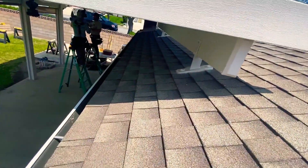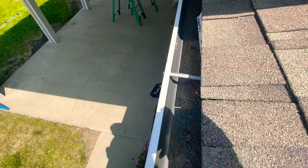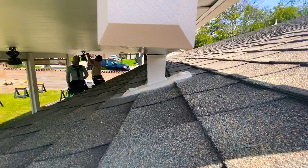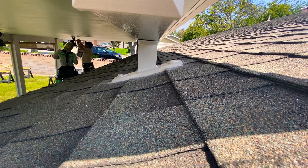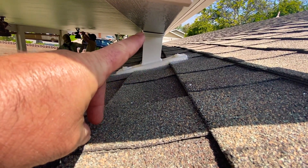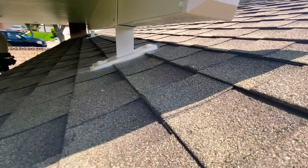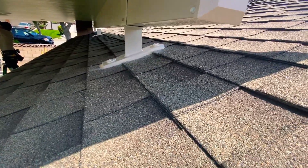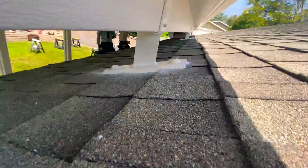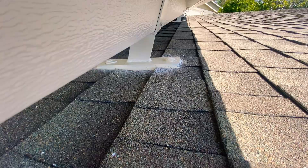So here's a side action — roof mount beam lift. The rain gutter is going to catch all of that. Hopefully that's helpful for you folks looking at our roof mount videos. Right here, the distance between here and here is about five inches. Back here, it's about three and a half to four. Plenty of clearance for airflow — it can flow right through there, or to have the rain come underneath the patio cover. As the rain is coming through the backside of the bracket, we want to seal that bracket very, very heavy to make sure that the water does not get through and we're well protected.